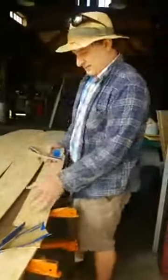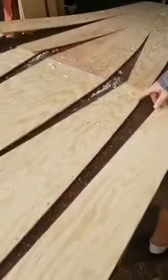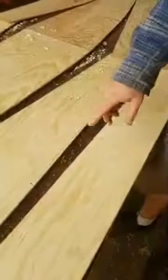The process is: cutting out the pattern, then gluing the two middle sheets. This is going to be the bottom board of the boat. Those were glued together last night with thickened epoxy. This morning I've been drilling these holes and beveling the stems.